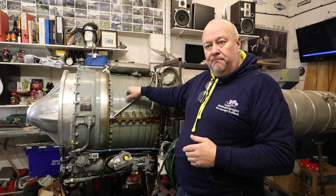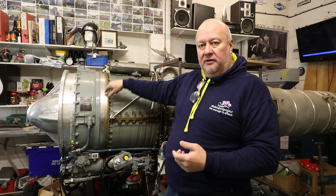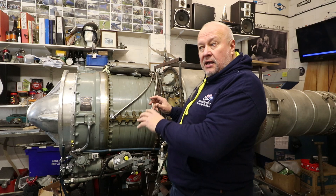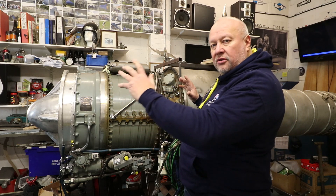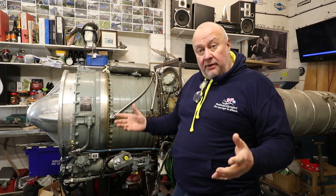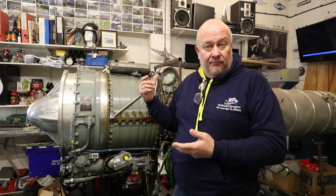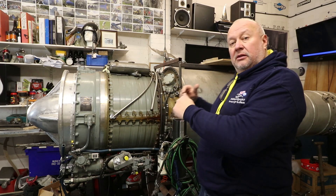So you can't just make it bigger and bigger. In a perfect world what you would do is make another one of these but a bigger one, run it at a nice gentle speed to get air into the front of the second compressor which is going faster, and optimize them both. Then to drive your nice big compressor at the front you put a nice big turbine at the back and run that at its optimum speed.